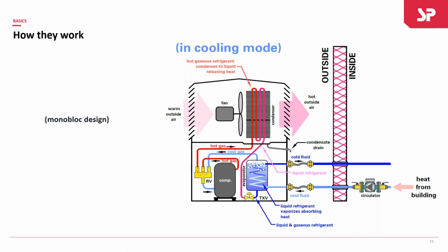However, if you do not use antifreeze in a SpacePak air to water heat pump system and the lack of antifreeze results in equipment failure, a frozen heat exchanger, for example, it will compromise your warranty regardless of how cool you are and nice your installations are. We'll talk much more about that coming up.